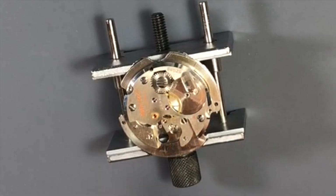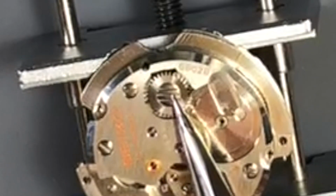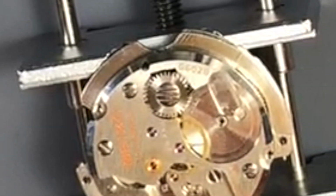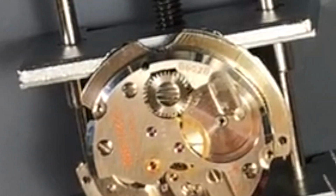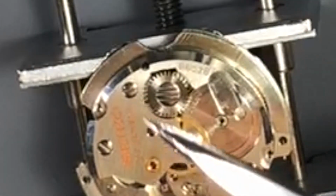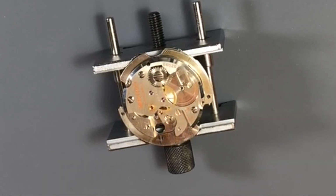If you ever find yourself disassembling mechanical watches, and I think it works this way for quite a few industries, if you see these slotted screws where there are multiple slots instead of just one for a flathead screwdriver, this typically indicates that it turns opposite the direction of a normal screw, a left-hand thread. So rather than tighten it to the right, you'll actually tighten it to the left and loosen to the right. Just worth noting if you are working with small mechanical items, and you can easily break a screw head by forcing it too far in the wrong direction.